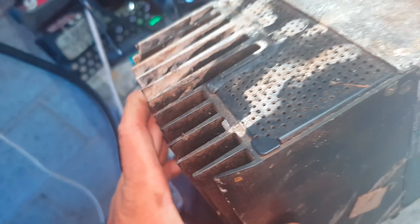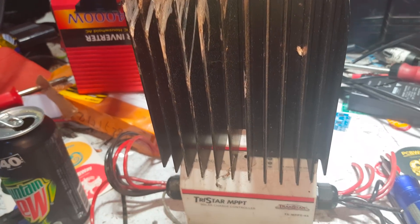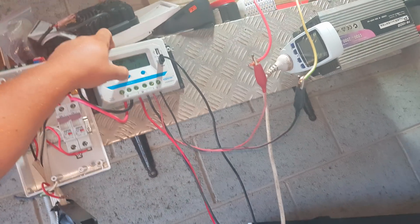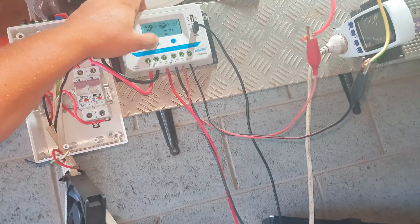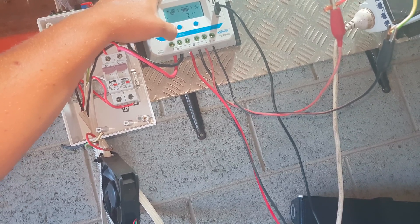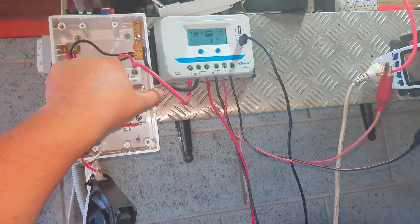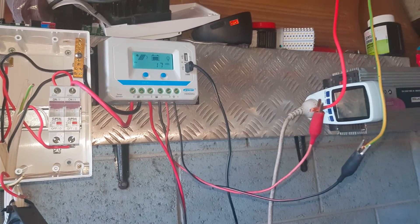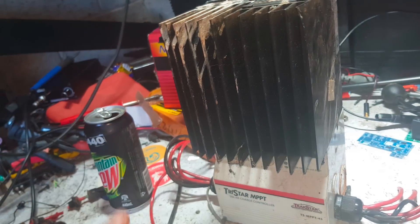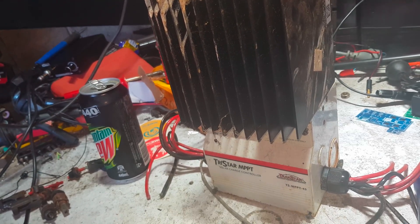As you can see it's vented to let the heat out of the inside, and it's well and truly heat-sinked. We're about to upgrade to a 45 amp charge controller, which is really good because the current ones are 30 amp. The batteries are less than full now — I'm not getting much solar at all actually, just going under a cloud. The current controller will sit on 30 amps pinned and stay there, which is definitely a limiting factor. And it's PWM, not MPPT. So we will be able to upgrade to MPPT, upping it by 15 amps.